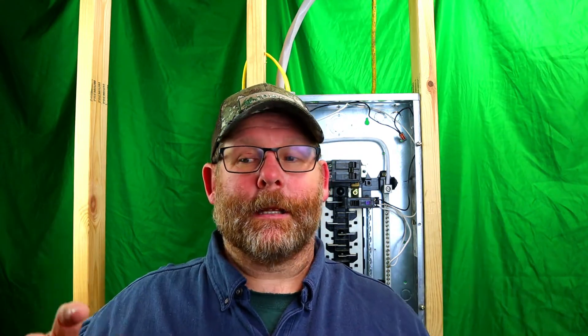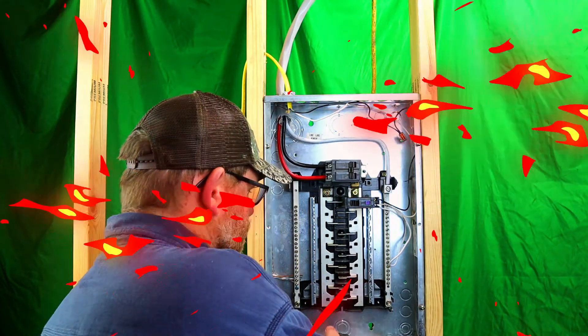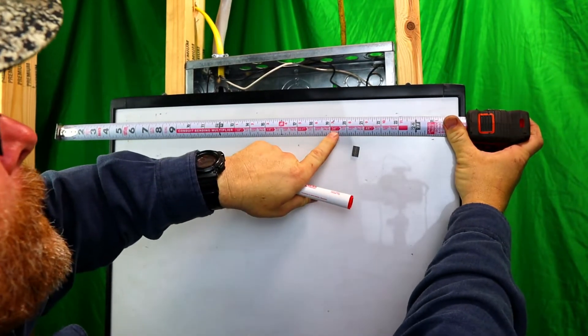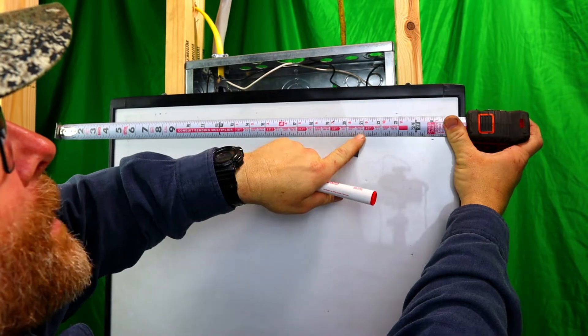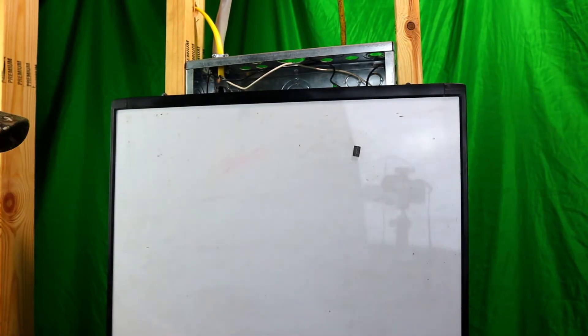We're going to have a short piece, bend it, and I think somebody was asking about a four-point saddle — how much it basically takes off. We're going to cover all of that. We're going to use this tape measure, and we know that bending on 30 degrees: the multiplier is 2 and the shrink factor is a quarter inch per every inch of take-up. It says right there on the back of this tape measure — you can also find it in the Ugly's book.